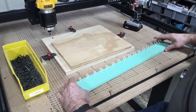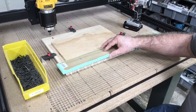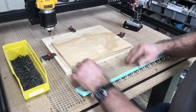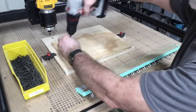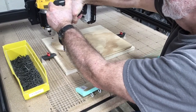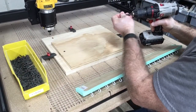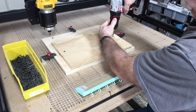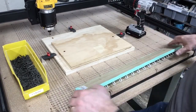The first thing I did off camera was secure an auxiliary base wasteboard for my CNC machine. But if you notice, if I put this up here, it still is not thick enough to get these hooks off of the original table. So to do that, I'm going to use a second wasteboard. If I put it right here and flip that over, then that gives me plenty of height to make my cut into the project. So I'm going to go ahead and secure that down to the table using a couple of screws.